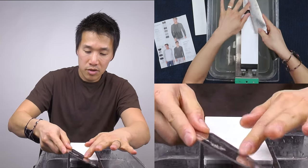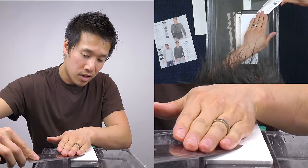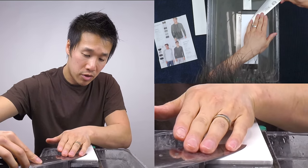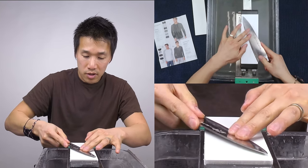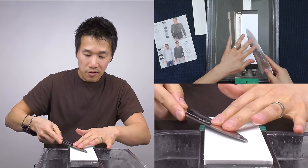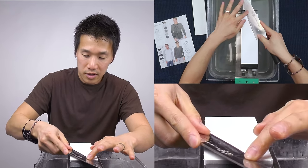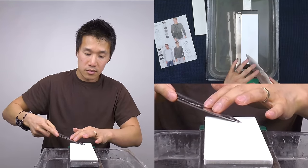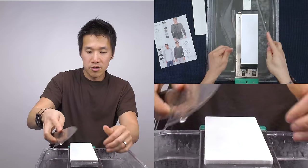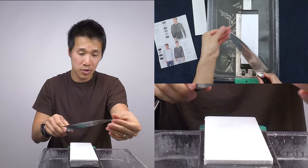These stones are designed to pull off material, so there will always be some lines — but what you're looking for are really obvious harsh lines. I'm not seeing any obvious lines now — just a hazy pattern. I'm going very slowly and very gently on the stone. By this point, my knife has no more meaningful material for the stone to take off — you're done. Some folks will go onto a leather strop to pull off more material, and that's perfectly fine. I stop there.